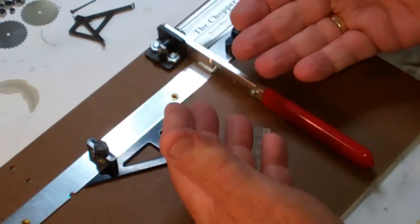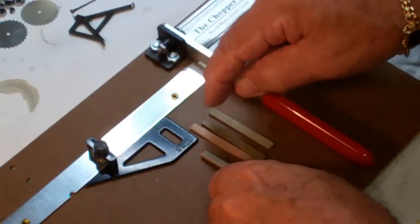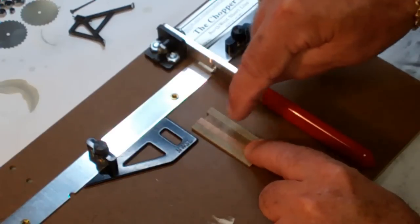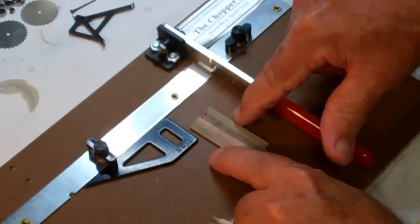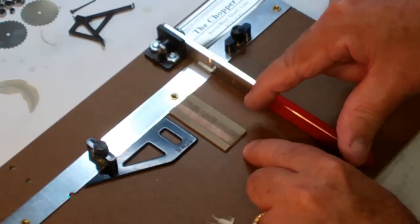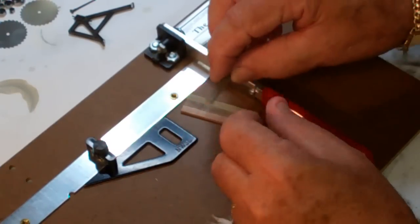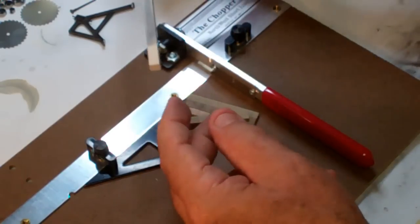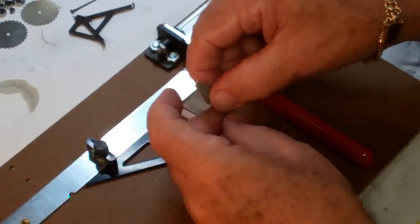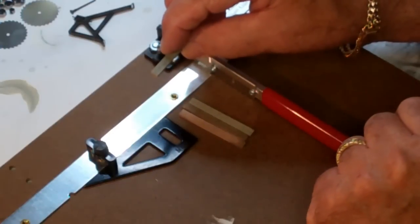Keep the blade down because if you get your hand on it, you're going to get a severe cut. You can see from this sample — you get various shades just from the variety of staining, brushing, and weathering we put on there, giving a nice combination. These are all going to be identical — dead on, everyone is identical. On larger pieces, like a 12 by 12 where you've got a large end section, the blades do cut on a slight slope. In that case I'll take it to the disc sander and just lightly touch and press it in, which gives me a dead flat end for that piece.